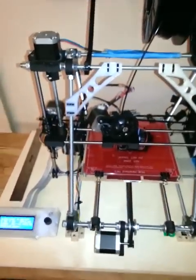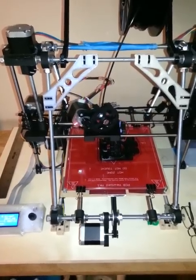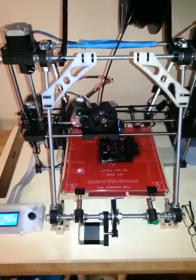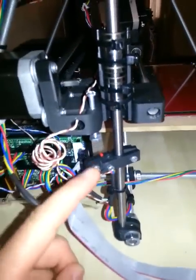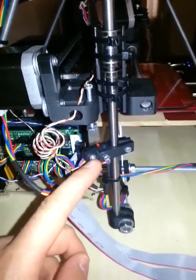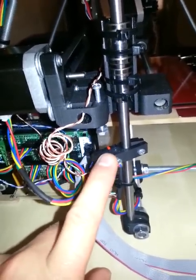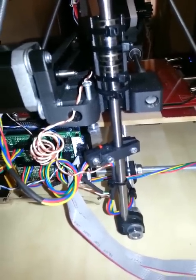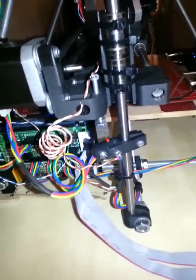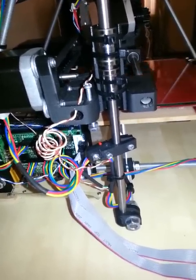It's very fast and easy to set your end stop for your Z and then level your bed. So we'll start over here on the X-end, and rather than try to fiddle with adjusting the switch up and down — first off, you'll notice I took the metal paddle off. I'm using the nub of the switch as a direct contact point. That's a slight bit more precise than with the metal paddle, because with the metal paddle there's some flex, and you could have a half or maybe a quarter of a millimeter variance on where it's going to stop each time.